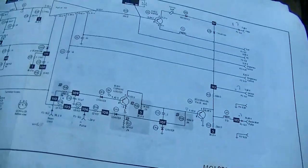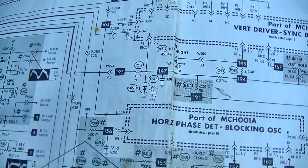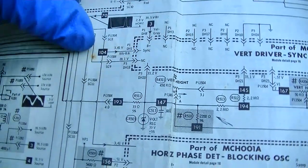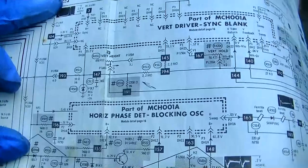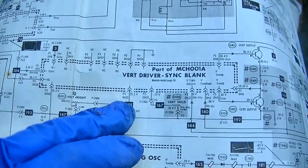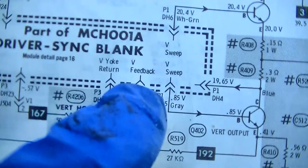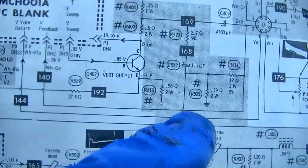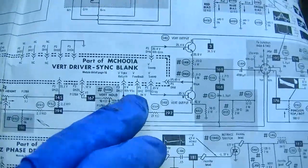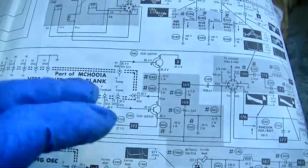Where is the vertical oscillator? That's the question. It looks like that is just a sync line because you can see it feeds into both the horizontal and the vertical. So this has got to have — be the vertical oscillator. Now whether it's a feedback loop — it does say vertical feedback right there — and that comes right off of the yoke. So I don't know if this is a big loop or if you could pull these two transistors out and the oscillator would still run.